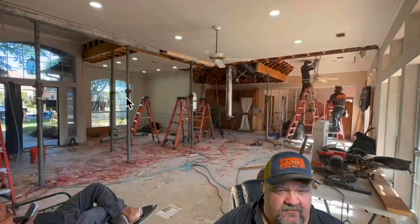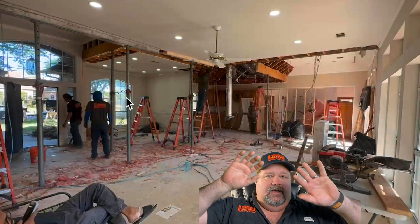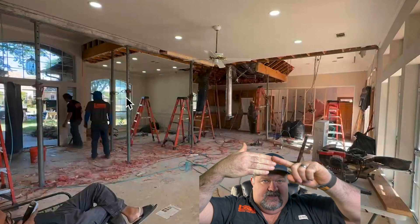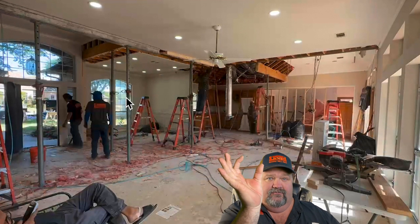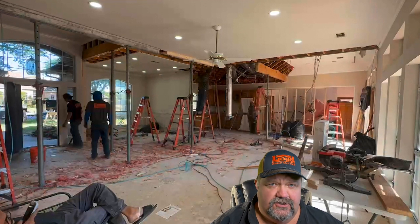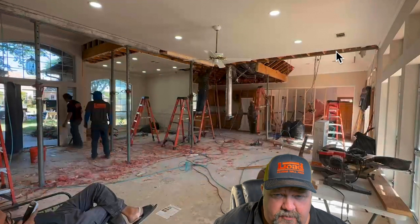The next part of the job is to tie all this together. We have a beam in the house and now we've got to connect everywhere where the house connects to the beam. We put little silver joist hangers — they're like little stirrups — and each of the ceiling joists sits in a stirrup, then the stirrup is nailed to the face of the beam.